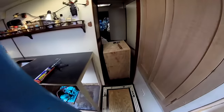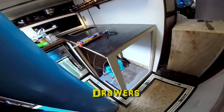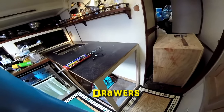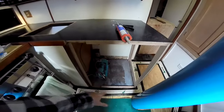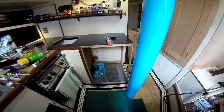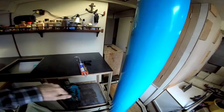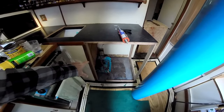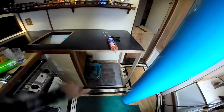Okay, so Brett is putting the box for the shelves in. He's got the fascia that he's putting in. He's using this glue, and he's also going to put some screws in it. Fascia for this side is over here. That cutout's going to be an access door so I can get to the compressor wiring and all if I need to. Ultimately, the shelf box will be screwed in. We're not going to glue it in. So in case I do need to get down here and have extra room, I can loosen the screws, slide it out, and do all the work I need.